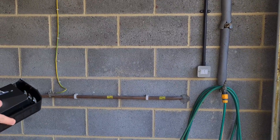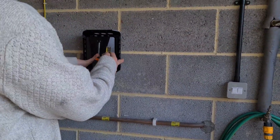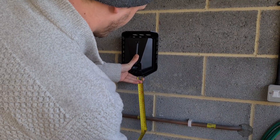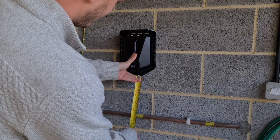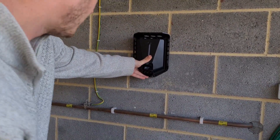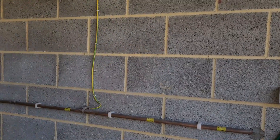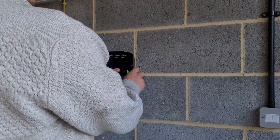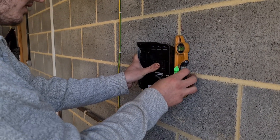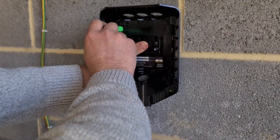The gas pipe is in pretty much the most awkward place possible, but we'll work around it. We do have to keep a minimum distance away from it — if you're not familiar with the rules on keeping cables and equipment away from gas pipes, go and check them out. You can run cables closer to the gas pipe than you might realise, but other equipment needs to stay a safe distance away. You can see Matthew checking for that before marking his fixing holes. The gas pipe is bonded and, because we can see its entire run with no joins, there's absolutely no issue with that.